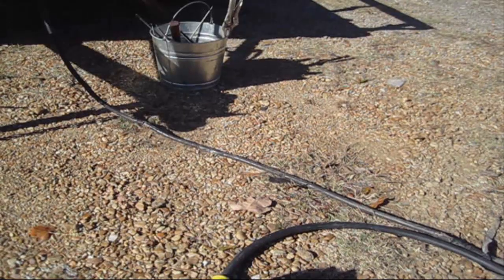I got a good fit. I've got a good bevel on there. This is a Schedule 80 pipe, I do believe. So you really want that rod to bury in there. You see I'm jacking it back and forth, trying to get it to close up. Now up here at the top, if you notice right about here, it starts to get a little too hot on me. I didn't feather that tack as much as I should have, and it opened up more than it closed, and I'm sitting here trying to battle it back and forth. But that was a good pass. That's something that you can take from you as a good root pass.